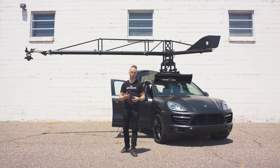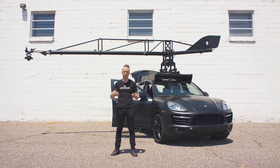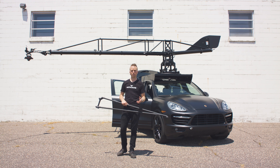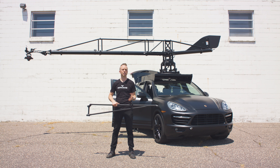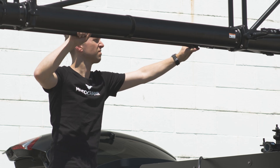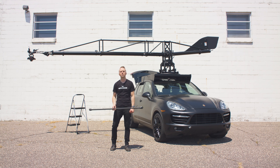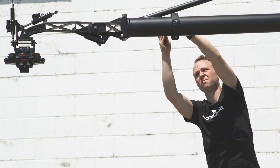Because we're building the LS kit in 14-foot mode, we're going to use the 14-foot lateral brace adapter, which allows us to use the full set of heavy lift braces included with the kit. Now that the 14-foot lateral brace adapters are attached, we treat the rest of the heavy lift install as we would on a standard unit — except instead of attaching the center brace to the passive or active mount on the fulcrum, we attach it directly to those 14-foot adapters. The last piece of front boom assembly is adding the heavy lift end braces from the center brace to the end brace mount on the front boom.